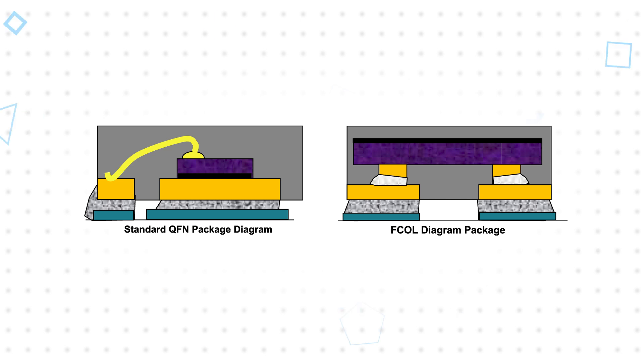This method eliminates the wire bonding typically used between the lead frame and die, allowing for a smaller package size and higher I/O density. The flip chip construction also has lower inductance and resistance than wire bonding, which reduces or eliminates ringing in switching waveforms, improving performance and reducing EMI. This is in addition to the driver's configurable slew rate and spread spectrum clocking that also reduce EMI.